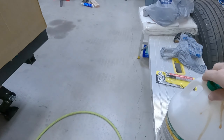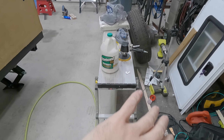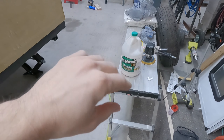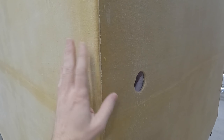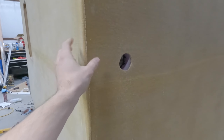So I went and bought a gallon of Titebond 3. This stuff is about double the price of Titebond 2, but it is supposedly 100% waterproof. The negative, besides price, with Titebond 3 is they say it won't stick to itself. So if you use Titebond 3 instead of Titebond 2, you're going to have more problems with these laps. I don't know if you can get a piece of canvas long enough to do the whole thing without a seam, but you're going to have seams, so you're going to want to use Titebond 2 for those.